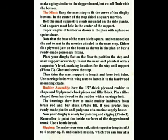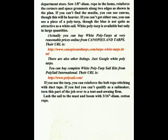Either fit a plywood jaw on the boom as shown in the plan or buy a ready-made gooseneck fitting. Place your dinghy flat on the floor to position the step and mast support accurately. Insert the mast and plumb it with a carpenter's level, marking locations for the step and support. Photo G. Glue and screw the step. Then trim the mast support to length and bore bolt holes. Use carriage bolts with wing nuts to fasten it to the hardwood mounting cleats.